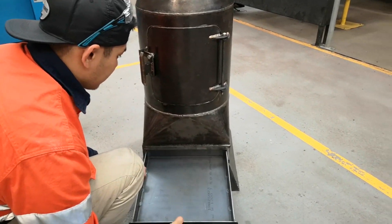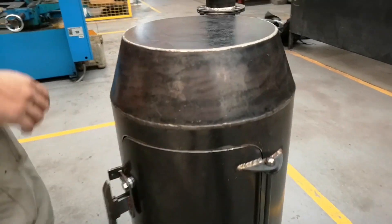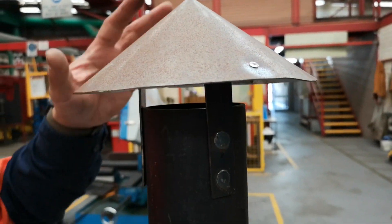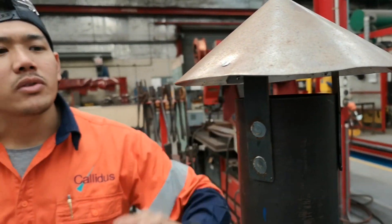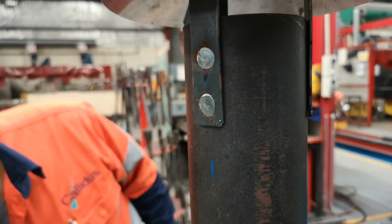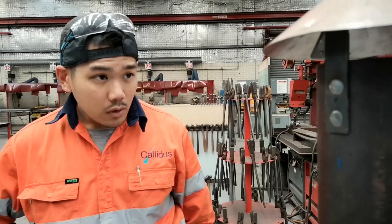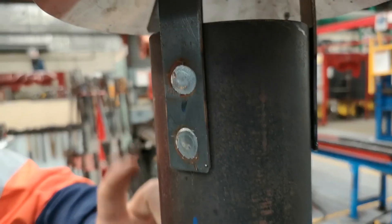Let's have a look at the lobster back, the cowl, and how you've plug welded that. The cowl up top — I riveted it in. Made a pattern development for that, then cut that out by hand. I believe it was just tin snips we used. Formed it by hand because it was only about one mil — I was able to just form it by hand over a horn and an anvil. Then plug welded it onto the chimney. Nice and simple, nice and solid.